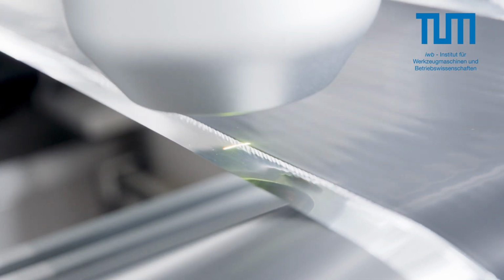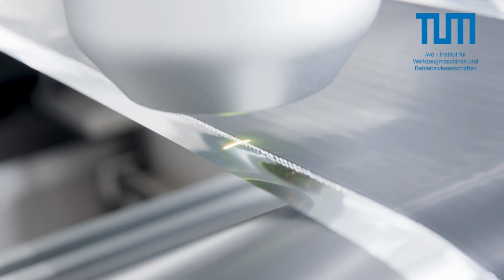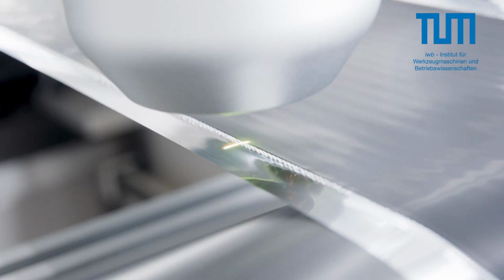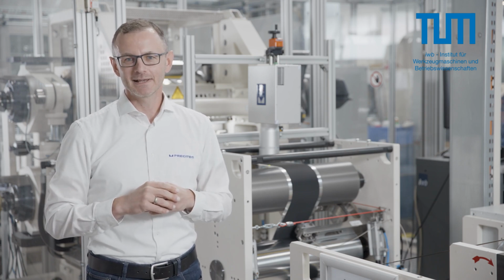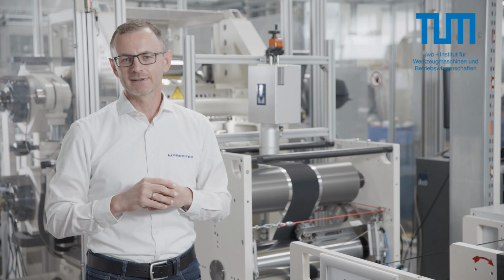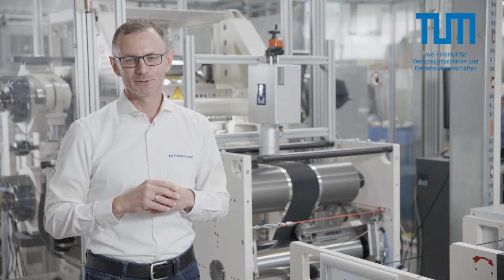If we measure that the wrinkles are too big, we could, for example, increase the tension on the electrode or increase the temperature of the rolls. Both have a positive impact on the yield behavior of the material. For this measurement task, we make use of a chromatic line sensor, CLS, with a line length of 20 millimeters, and some of the results will be shown next.